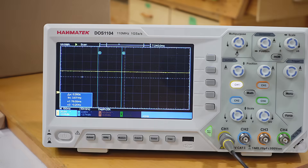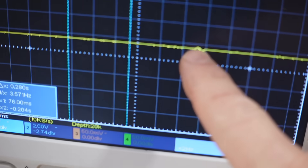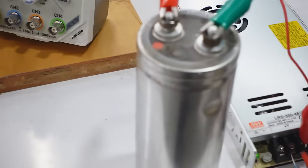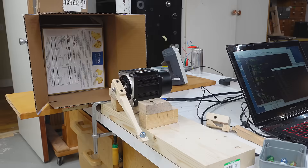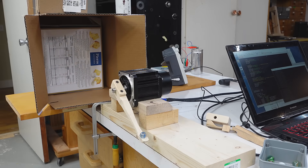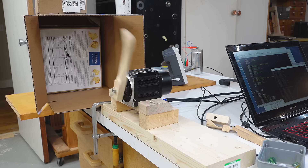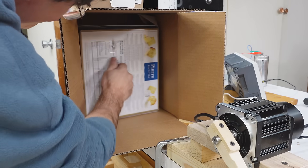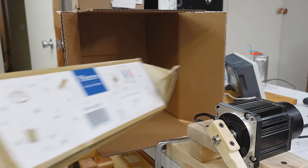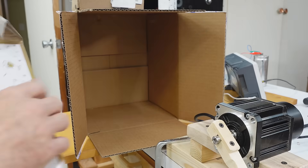Yes! There's just a little wiggle on the supply voltage now, so that cap takes up everything — I guess it's a lot bigger than the ones in the supply itself. That kept hitting that same spot pretty consistently and the back of this box is kind of banged up too where they hit on the back.